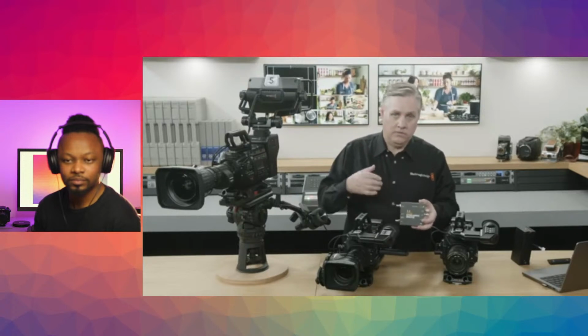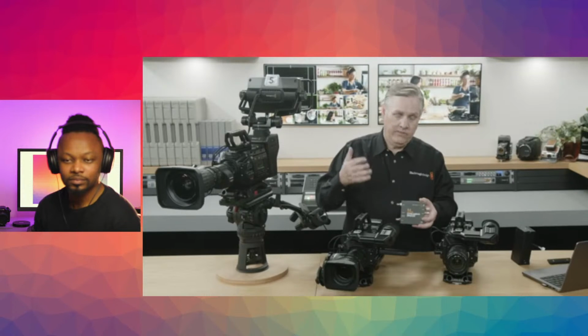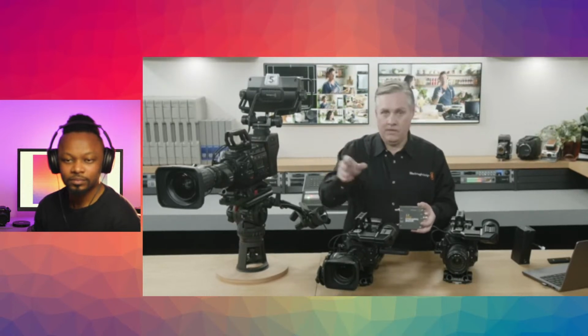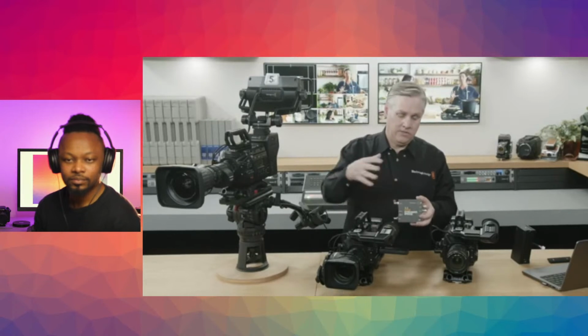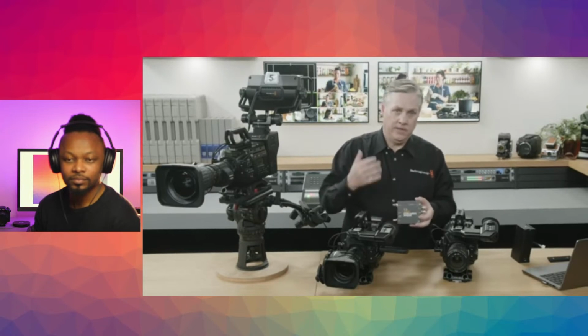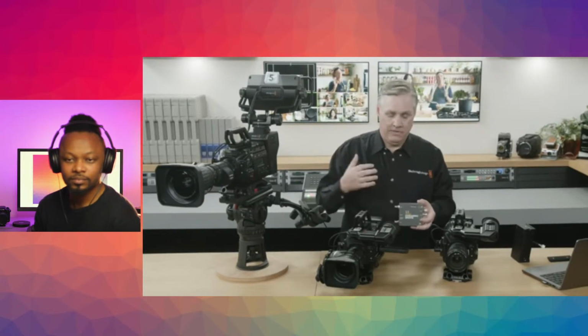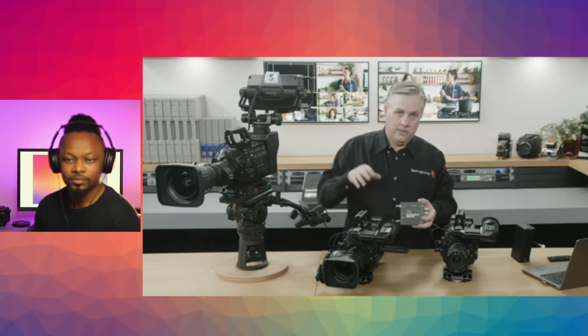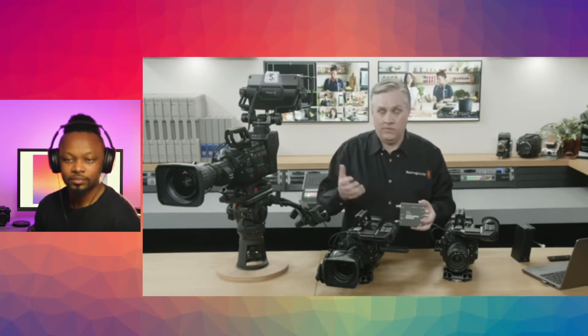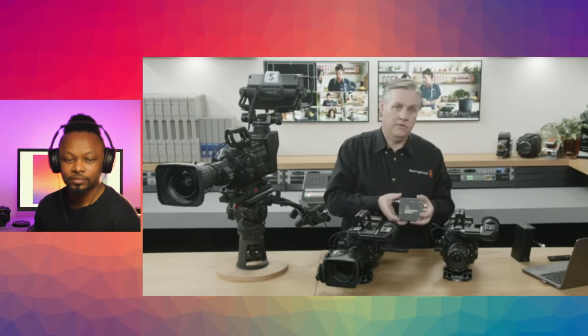And the HDMI streaming bridge will basically receive a live stream from the camera, but it'll send the tally and camera control back up to the camera, almost in the opposite direction of the video stream. So it's not just receiving the video stream and converting to video, it's feeding it back the other way. Now, it basically works the same way as connecting the SDI from the switcher to the camera control. When you plug a switcher into the camera directly using the program return, it's the same as that, but obviously you can't do that with remote cameras because they're too far away. You're using a streaming link to do it.